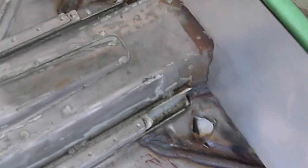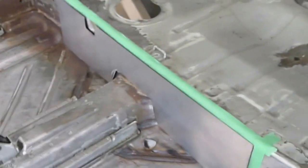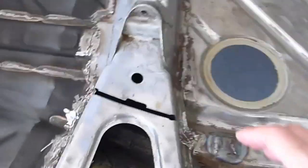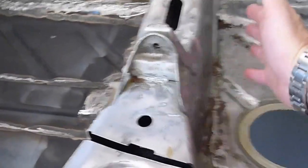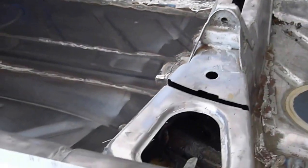This piece here is a 16-gauge piece of material that basically goes in there like that, and that stiffens up this area at the back providing some stiffness. Then across the seat area I'm going to add some additional metal to stiffen it and connect it to the center cross.